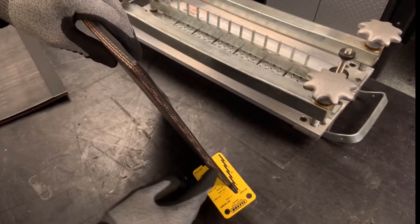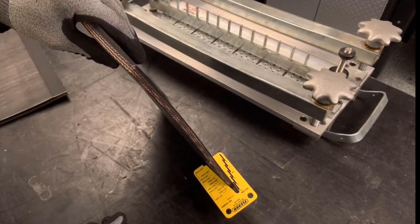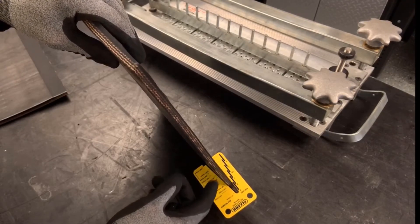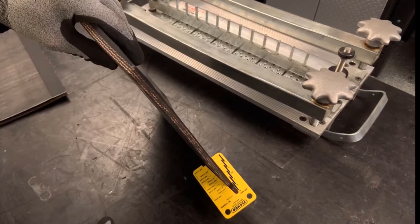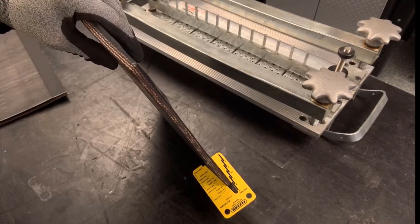Since I'm going to be doing a hammer installation, I'm fine using either a B or an A rivet. If we were using a power tool, I would recommend using an A rivet because we're going to get extra compression of the rubber ply belt.